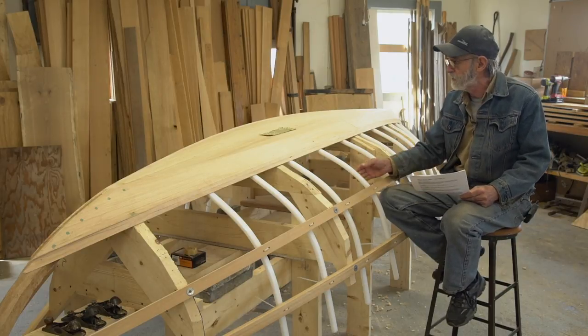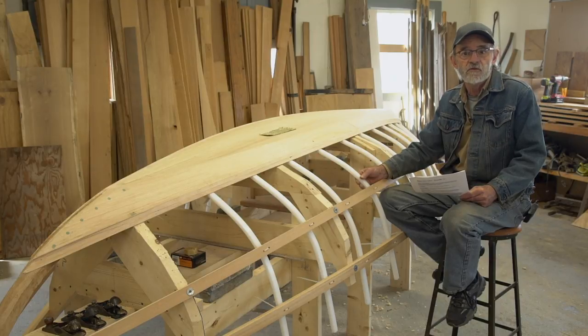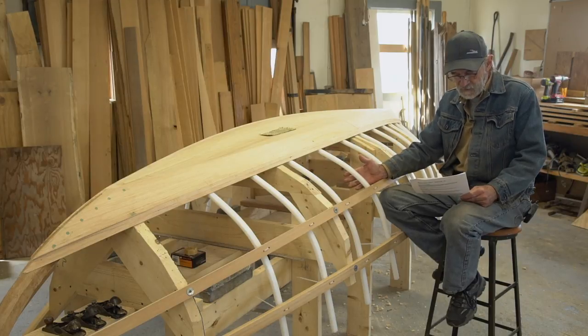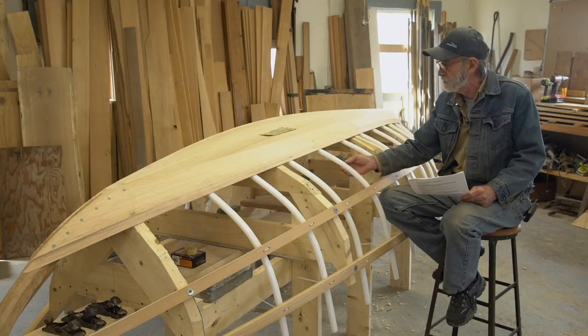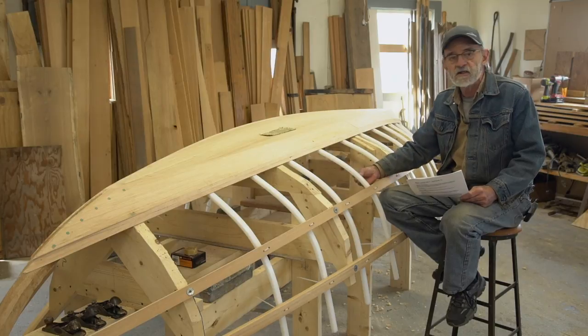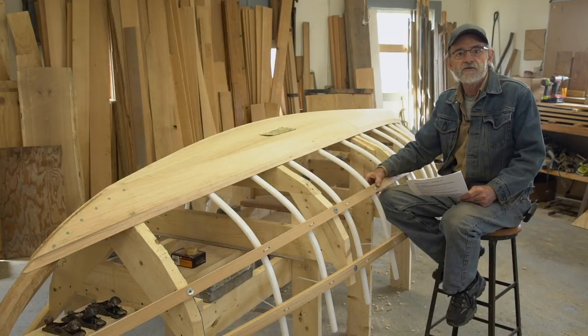I've put quite a bit of it in fishing boats where the frames have been broken in the turns of the bilges. And I've just come to trust it in just about every which way. And I just don't have those concerns. I think that if someone was concerned about the sunlight breaking it down, you can sand it lightly and put a coat of paint over it. And that'll stop it right there in its tracks.